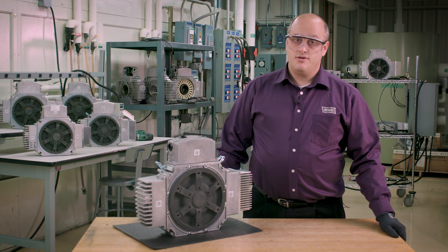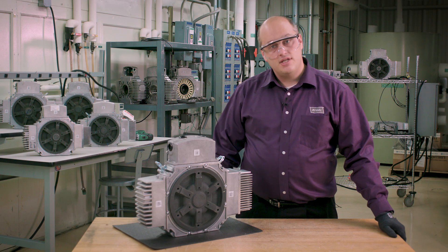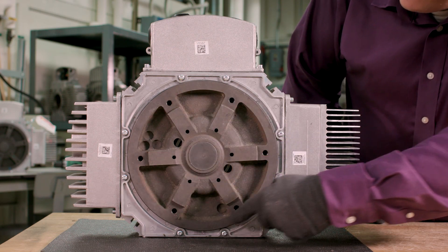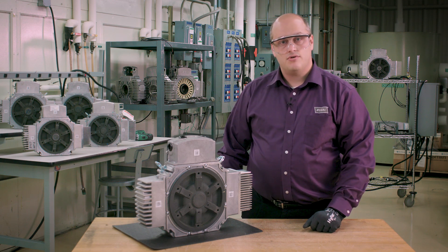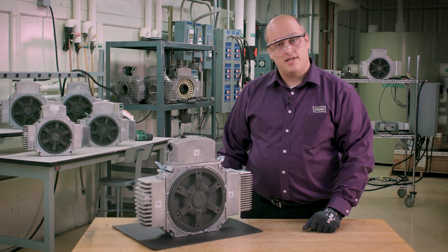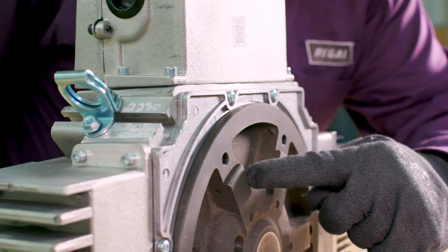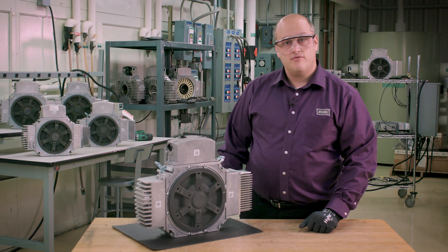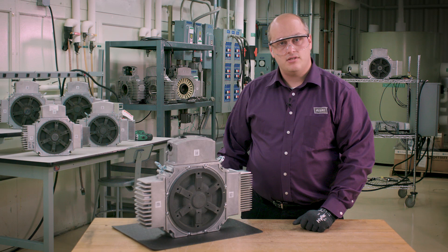Now that you've considered the elements required to mount the motor into your assembly, we will discuss the elements necessary to permit mounting the fan to the motor. There are six mounting holes to affix the blower to the motor. Plan to use coarse-threaded 3/8-inch fasteners with at least half an inch of thread engagement, but not more than 3/4 inch, as that is the guaranteed thread depth. To ensure concentricity and ease installation, there is a rabbet on the face of the motor. The blower backplate should be designed to fit right up against the wrap, but be sure that your fan does not cover up the eight holes near the center of the rotor face. These holes allow cooling to take place inside the motor.